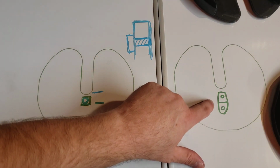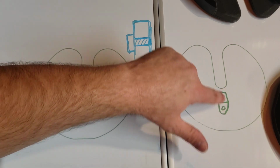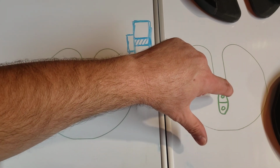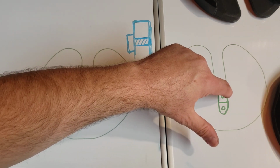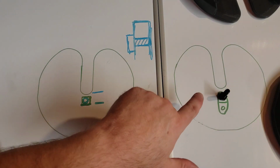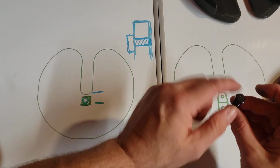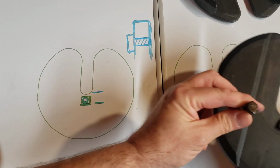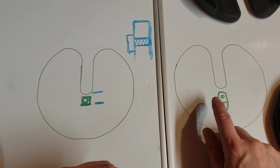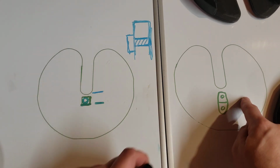If you have this type of assembly, you can do the same thing. This assembly is, of course, riveted onto your plate. If it shears off, you can drill a hole in the right location, okay, here, and tap it and make sure that you install your bolt. Of course, it would go this way. This head has to be on the same side as the tab would have been. So this would get turned into the plate this way, and this would function as the missing metal component on this style of disc as well.